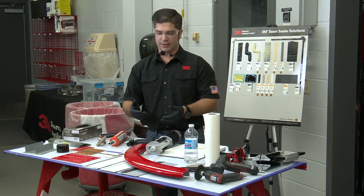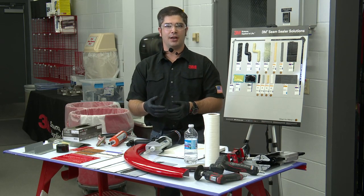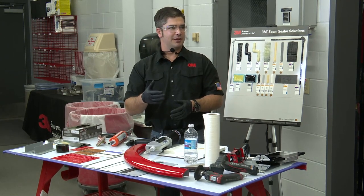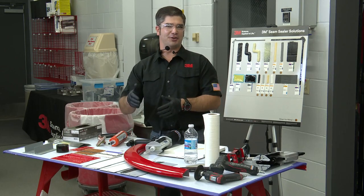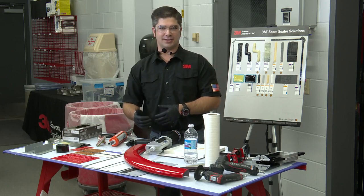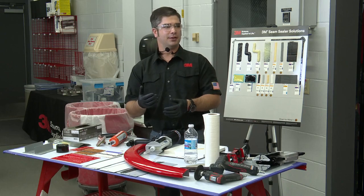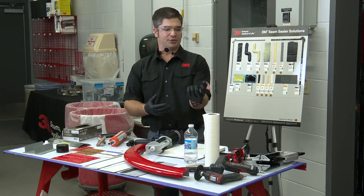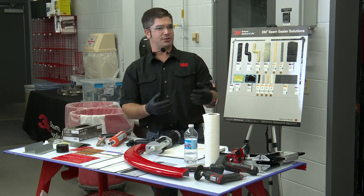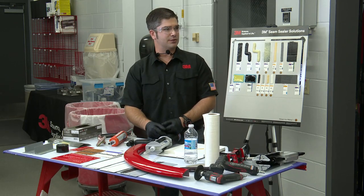One of the important things to point out there is that if you're using a 2K acid etch and then a urethane primer, you're not skipping, and this is key here, Jason, the urethane primer part. A lot of guys will put on the 2K acid etch, then they'll apply the seam sealer, thinking that the metal's got appropriate protection, but it doesn't, right? That acid is on the surface waiting to marry with the urethane primer. So it's actually 2 processes in which the primer has to be applied, versus an epoxy primer, which is strong.